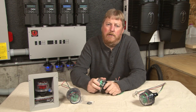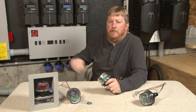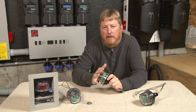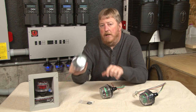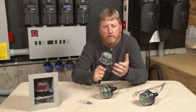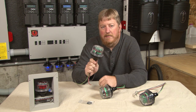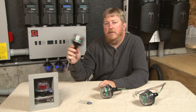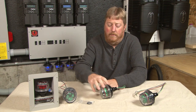SPD-300 is good for DC inputs to MPPT charge controllers. It's also good for 120, 240 AC — regular residential AC. The SPD-600 is primarily meant for grid tie inverters, 0 to 600 volt DC in, also good for 480 three-phase AC power. If you have a residence or a building that has industrial power, three-phase power, 480 volts, you can use a couple of those to protect the three-phase.